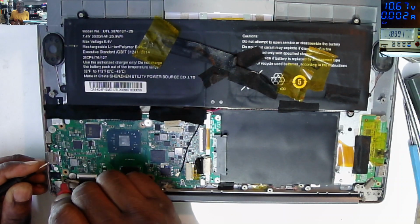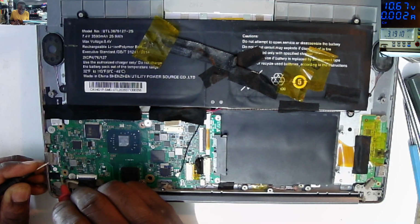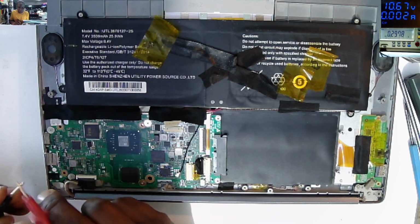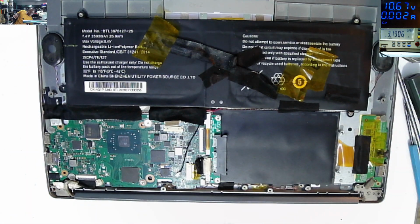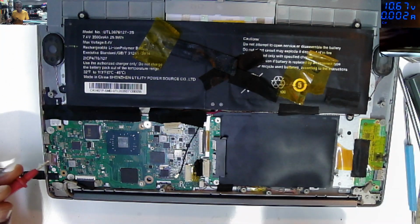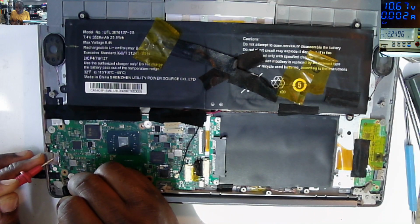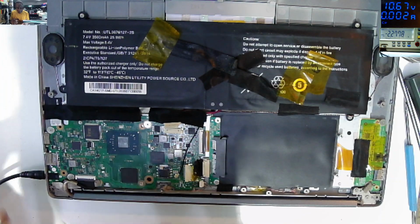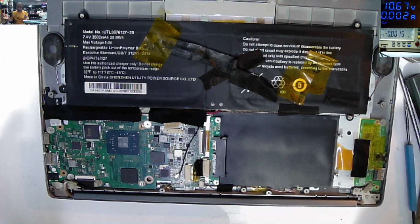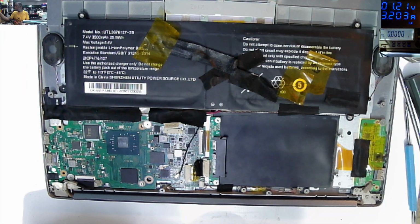We don't have a short to ground. You can see on the screen. I'm checking on the plus pin, just on the charging port, with the multimeter. It's not like 0, 0. Again, plug the charger. 2 point something volts. Okay, my DC power supply is set on 10 volts, 3.2. Let's lower the current.